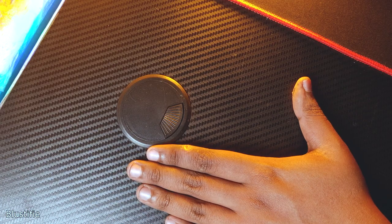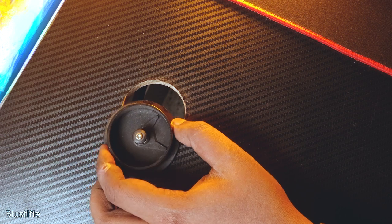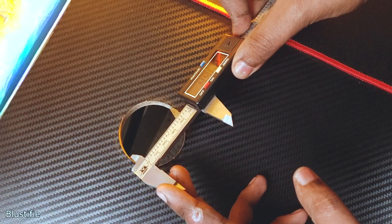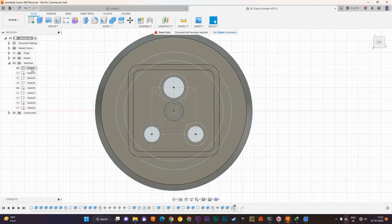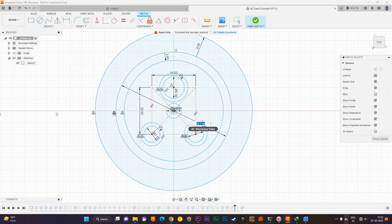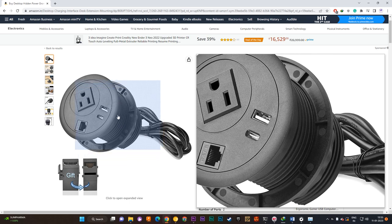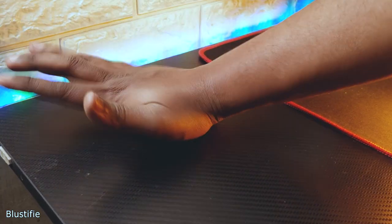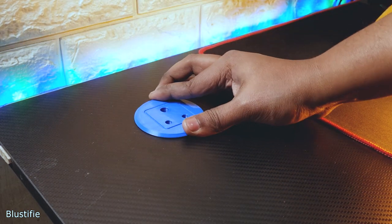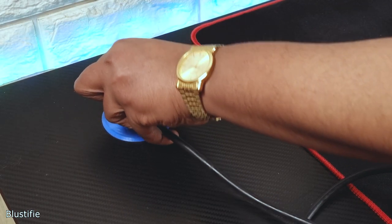Also, the gap between the plug body and the socket pins is mandatory to measure, as it will later help decide the thickness of the body. Next, I measured the size of the hole in the table. I removed the old grommet and measured the diameter, which is almost 50mm. Considering the error of my 3D printer, I adjusted accordingly. This measurement is important because in my design I am not adding nuts like the commercial ones, so I have to make this grommet as tight as possible — because while removing the plug, the grommet should not leave its place.